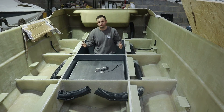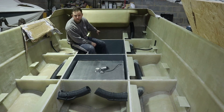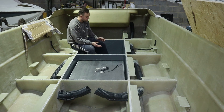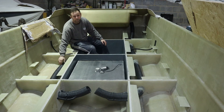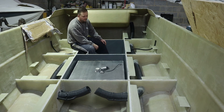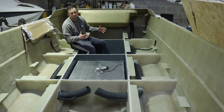The compartment I'm sat in now is going to be for the transducers. Last time we mounted them in the last compartment, but we're bringing them slightly forward — some people say the more forward you mount them the better the signal quality overall, so we're giving it a try. The cables can be run through this side up into the console as well. Transducer cable is quite large, and with the deck down anyone could retrofit or upgrade with multiple systems easily.